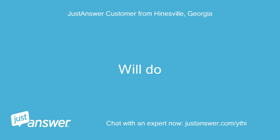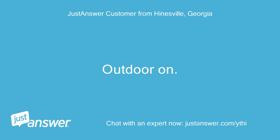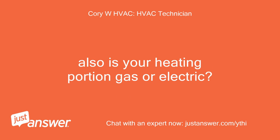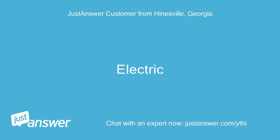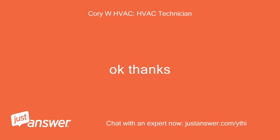Will do. Let me know when power is back on to outdoor only. Outdoor on. Indoor off. Okay, thanks. About 5 minutes and turn on indoor power and go to the control and watch it boot up and let me know what it says. The boot up may take a few minutes. Also, is your heating portion gas or electric? Electric. Is the outdoor a heat pump? Okay, thanks.